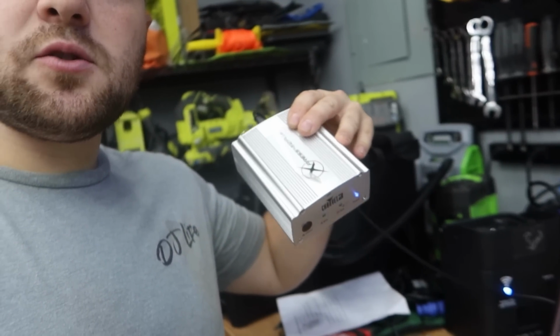Secondly, wireless DMX. So you have to have one of these wireless DMX transmitters to work with these lights. So this right here is what communicates to the lights, to tell them what to do. Now you have to plug this in to some sort of DMX interface, whether that's the Show Express right here. This is a Show Express box. There is a Sound Switch box. ADJ makes a box, but you have to have the DMX output hardware as well as the software on a computer to run these lights. Actually, some of them have iPad control, like the ADJ Wi-Fi or ADJ My DMX Go, I believe, it's an iPad interface, but you have to have a DMX interface.